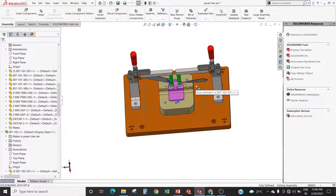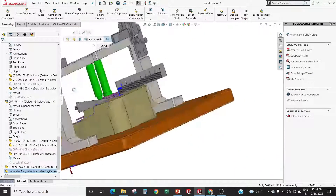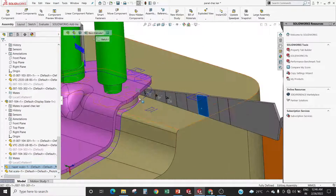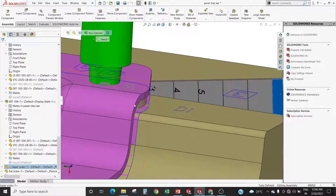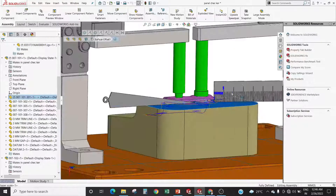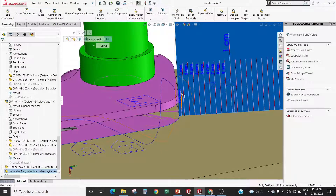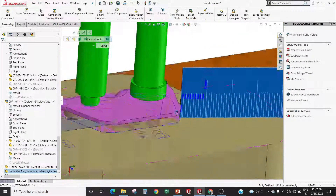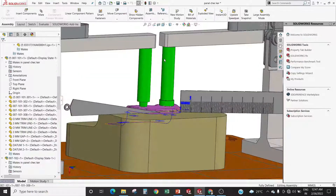Now we will see how to check the gap and trim of the part. By the help of a taper scale — this is the taper scale and this is the flat scale. By the use of the taper scale we check the part profile gap, meaning the gap between the component and the profile block. By the use of the flat scale we check the part trim — how much the part is out from the zero line, and whether it is under tolerance or not. By the use of checking pins we check the hole CD and hole size.